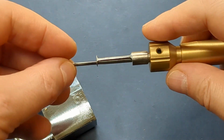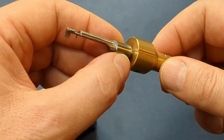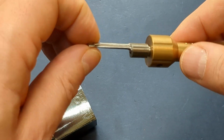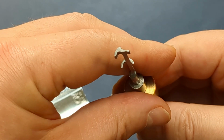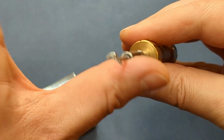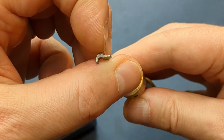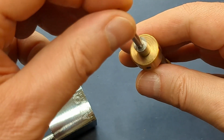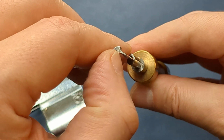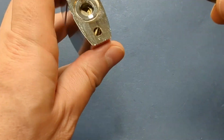What we have here is a 4mm ejector pin and the sleeve that came with it, which started off as an 8mm sleeve, and then I've just taken that down a little bit so it'll fit inside a 7.5mm diameter half circle. Now the end might look a little bit strange. You can see there, taking a big chunk out of there, and that is so that it will fit through all of the different teeth on the rear profile plate, and also all variations of the tooth on the front profile plate.